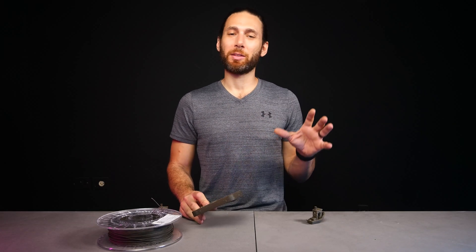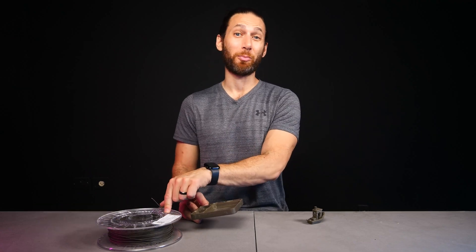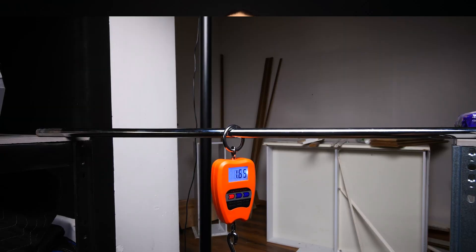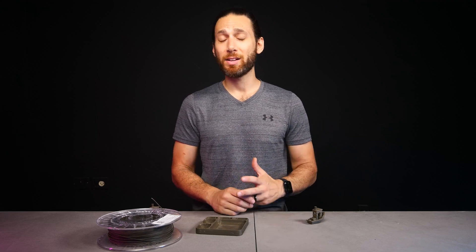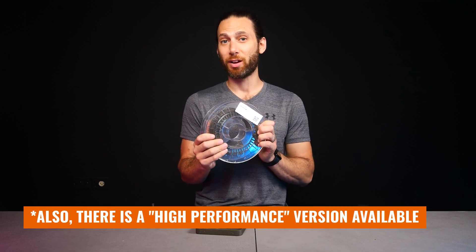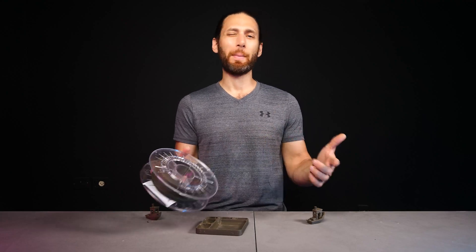I know you're probably curious about the material's strength. While this definitely isn't CNC Kitchen — drop a comment below if you'd like to see me FedEx the rest of this roll to Stefan for more serious testing — I did go ahead and buy some test equipment to see just how strong this stuff really was. I did use Stefan's exact settings for printing the hooks, but let's just say my methods were less than scientific, and I had a very small sample size. From my very limited testing, the environmental benefits do come at a cost — my test samples broke at about one-quarter the load of Stefan's PLA samples. I'm sure with more tweaking I could get much better results, and they do have a high-performance version available. But there's no two ways about it: the strength of this material is a bit disappointing, and it may limit its practical application.